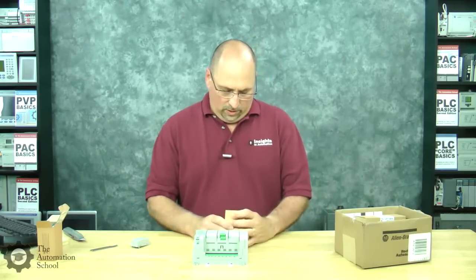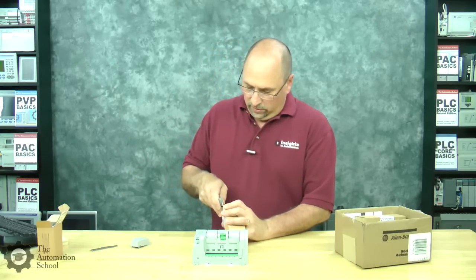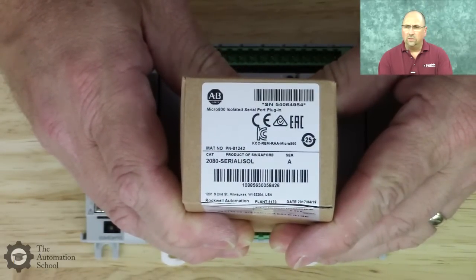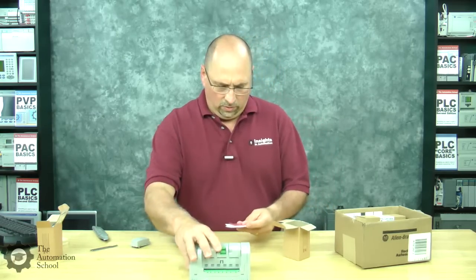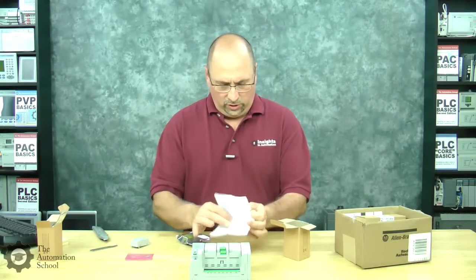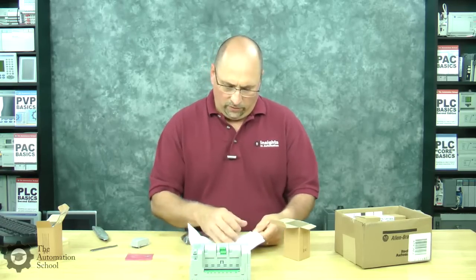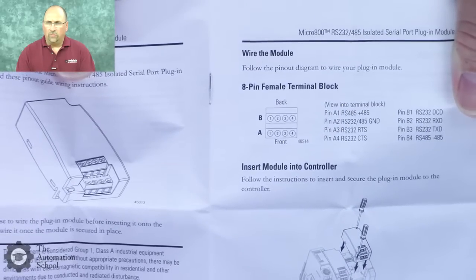And what else do we have here? Let's go ahead and open that up. Let me hold the box up in front of the camera so you can see the label — Serial ISO, so an isolated serial port. Good for doing Modbus. In the course, we're going to do Modbus to the PowerFlex line of drives. Let's see what we get in the box here again. We get the screws and the wiring diagrams. This is not a D-shell or a mini-DIN, so you'll want to be able to wire it up correctly. I'm going to be using it for RS-485, but I believe you could also use it for RS-232. Let's take a look and see what the book says. Yep — 232 and 485 supported.